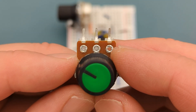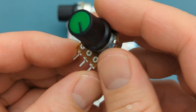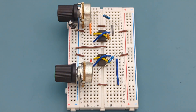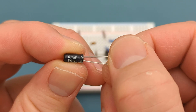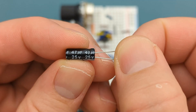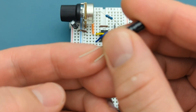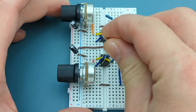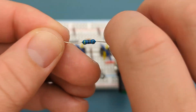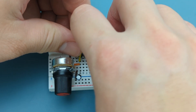Similar to the previous potentiometer, connect the 50-kilohm potentiometer to the second 555. Insert a 0.1-microfarad capacitor from pin 2 (trigger) to the negative rail — the anode is in pin 2. Insert a 47-microfarad capacitor from pin 3 (output) to a row below the 555, with the anode in pin 3. Bend the ends of a 4.7-kilohm resistor and insert it from pin 3 of the first 555 to pin 5 of the second 555.